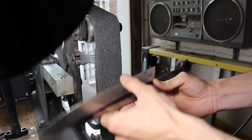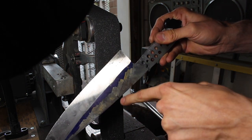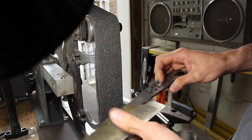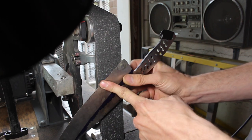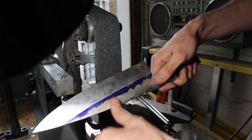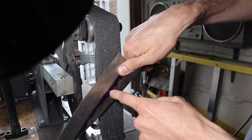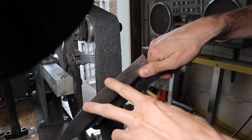A couple of things to note while grinding this knife: number one, I'm grinding it on an angle — that's going to help me keep that line from the heel up to where I want it to go, and it's going to help me prevent any hard pointed areas or corners digging into my grinds. I'm barely putting any pressure with my hands up by the edge because I don't need to remove much material from there anymore. I'm focused more down here, and as I'm grinding, I'm sort of twisting it as I get closer to the front of the knife to give it a slimmer profile up front. Keeping the knife on an angle and adding more pressure down near the edge rather than up at the spine — those are the two things I'm focusing on during this grind.